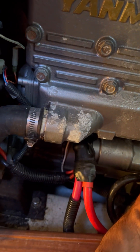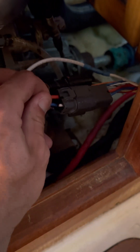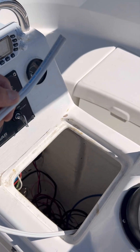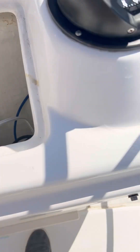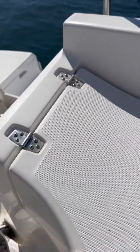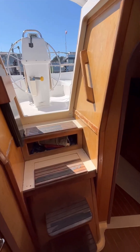Here we are down below at the motor. I tried to splice just past this connector. We took our 12-gauge wires — this end connects to the panel. We've run it down into the binnacle, underneath the floorboard, into the aft lazarette, down into the aft cabin, and out right here. Once again, we are bypassing this wire harness.